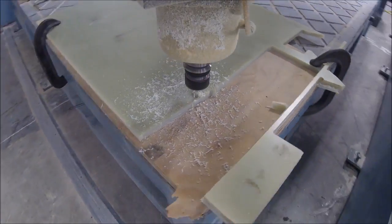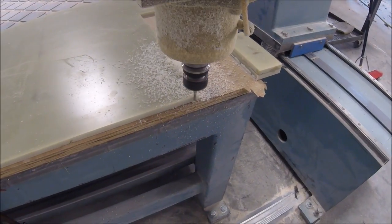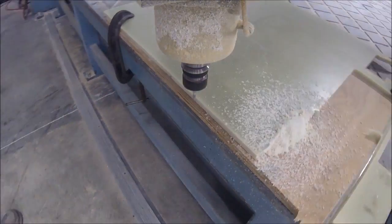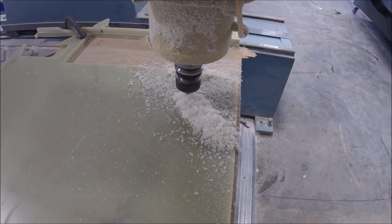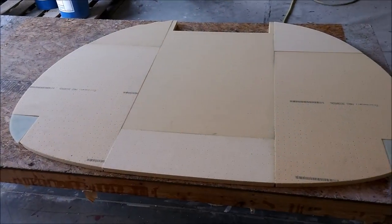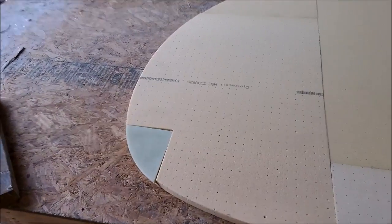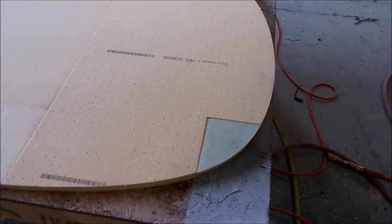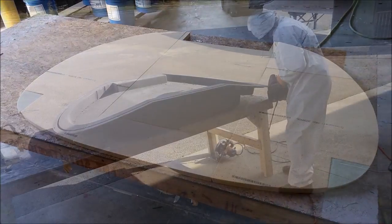This is sped up on the machine. Here it's cutting out the hard points - this is the FR4, which is pretty much solid fiberglass, cutting out those hard points for where the landing gear bolts into the aft bulkhead. Got those done, and there are all the different pieces laid out with varying thicknesses of core for what we need - some because of the pressure up the top of the bulkhead, and others where the landing gear bolts in.